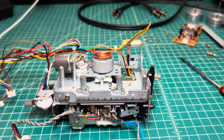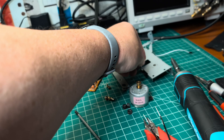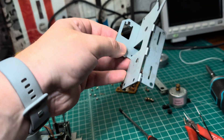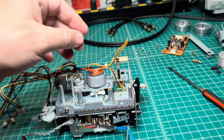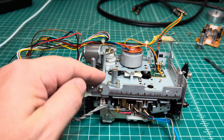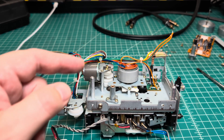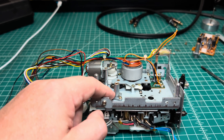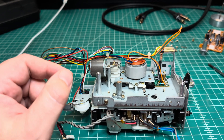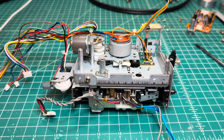I removed the motor and the capstan. I removed it from this board because it's needed to hold the playback amp board and provide enough shielding. Now I'm removing the capstan bearings — the first one, and then the second one. Then I'll start disassembling the other tape transport, because I'll need a different capstan bearings set and will need to install the stands from the other tape transport.